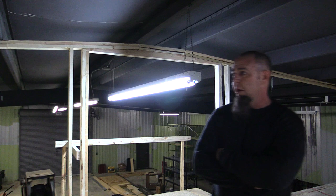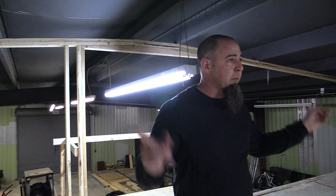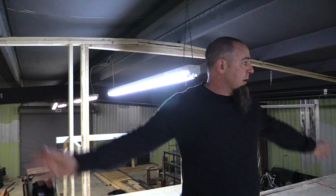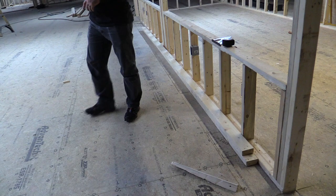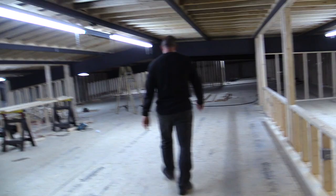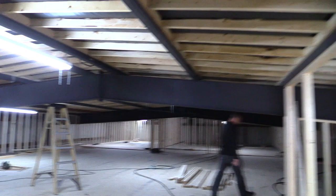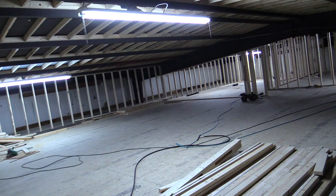The heat and air guys were in here — they've staged out where all of our lines, returns, and outlets are, so they start building tomorrow. We've got 400 feet of main trunk line going in, and that's going to branch off to the sides. We've got air vents coming in — two or three of them inside these offices, mirrored on both sides. Then the bathroom coming in here — I think we're doing a six by six bathroom right here. There'll be air coming in there, air over here, the kitchen goes here, and then there's a return here and a mirrored one on the other side.